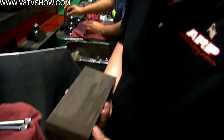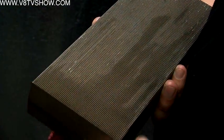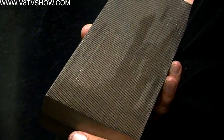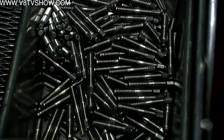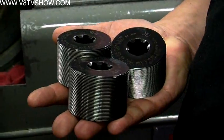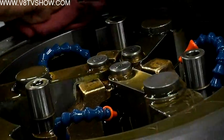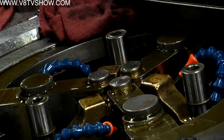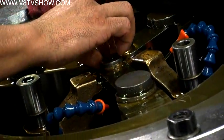Here's a thread roll die — there are two dies in this machine and it's a flat die. When you want to change thread pitches or sizes of the diameter of the bolt, you just change out the dies and readjust the machine. There are two different kinds of thread rollers depending on the thread and length of the fastener. This is a tri-roll — a three-die cylindrical die machine. The dies are operated by a cam; they open, the operator puts the part in, they come together spinning, and that rolls the thread onto the part.